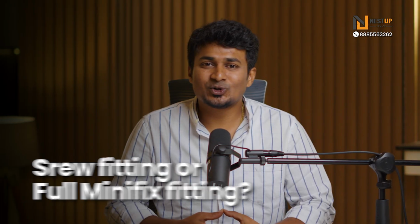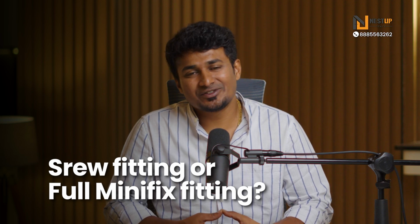Do you do screw fitting or full mini fix fitting? Actually, there are advantages and disadvantages in both of these. Screw fitting gives stability, mini fix gives better quality finish. We get the best of both worlds, hence we use a hybrid model.